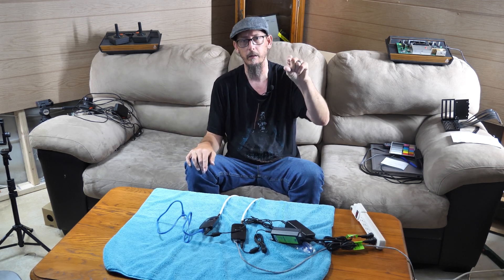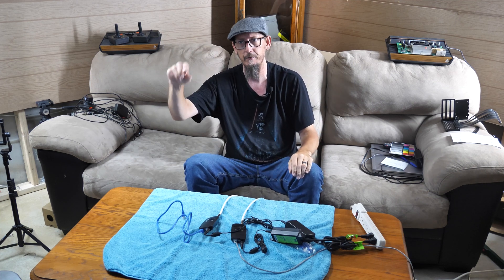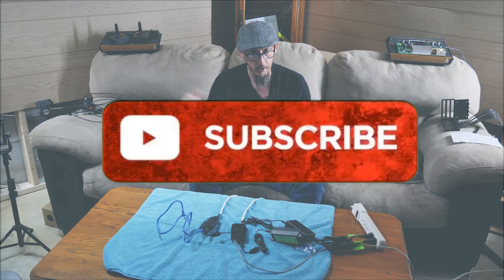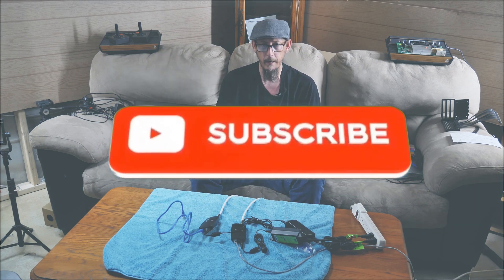I'll put every speed test result labeled — 10 feet, 100 feet, 150 feet, 200 feet, and so on — just to see how much it slows down with cable length. So let's go ahead and run a speed test on my network just to see what my speeds are through the Ethernet cables, and then we'll go over to this DirecTV DECA and see what we get on the coax. We already know the maximum is 100 megs on this DECA, so we know we won't get anything faster than that on the cable, but 100 megs is still good.